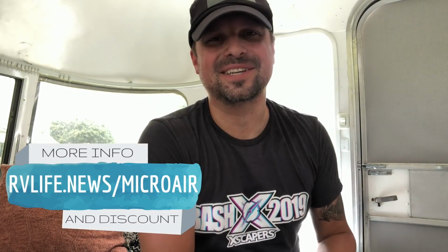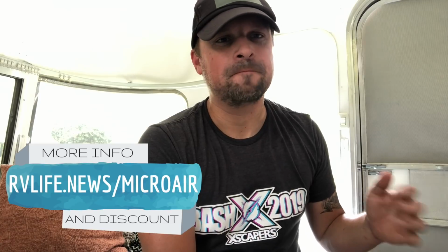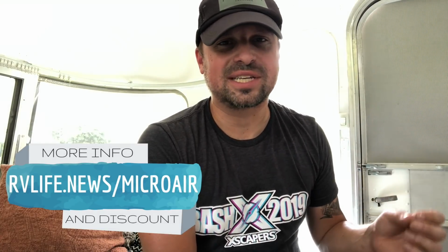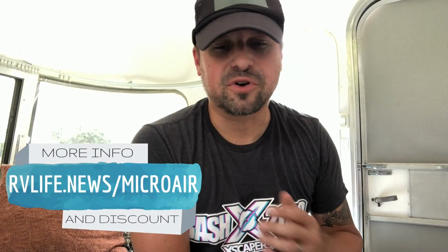Before we install the Micro Air, we have had some issues with the AC. We've run it off the Victron 3000, and it will run for a little while, but the inverter just can't handle the charge from the AC and everything else we have running. And the first thing that the folks at Battleborn told me was I need to get a Micro Air Easy Start installed. So that's what we're about to go do.